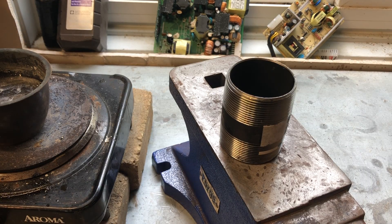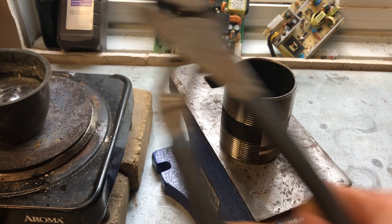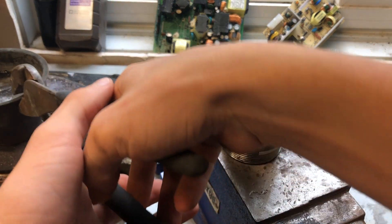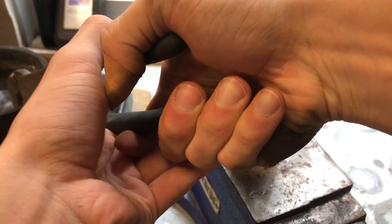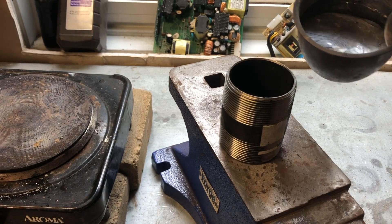I placed the black pipe nipple onto an anvil. The anvil acts as a thermal sump. When I pour the lead into the pipe, it will solidify almost instantly due to the coolness of the metal anvil. I did a few pours so as not to overwhelm the cooling, as I was worried about the lead escaping if I poured too much onto the bench.